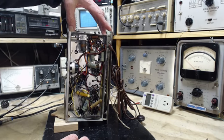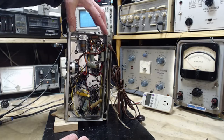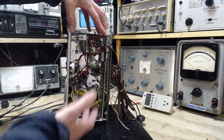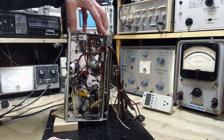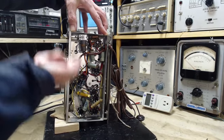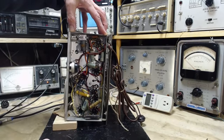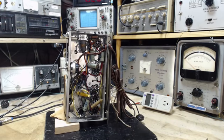It can take them from one area where they're strong, and those same signals can be in a part of the radio that's very, very sensitive, and actually come right back through the radio again. You can start getting feedback. All kinds of things can happen here, not the least of which is just a lot more noise being picked up by the radio.